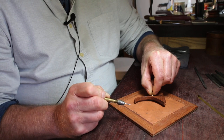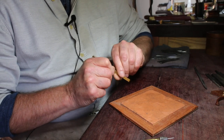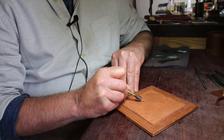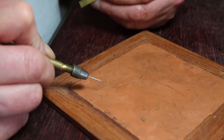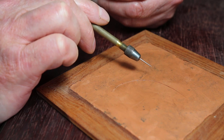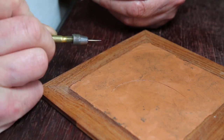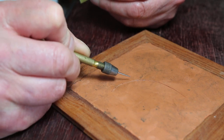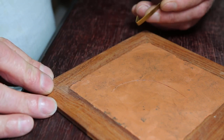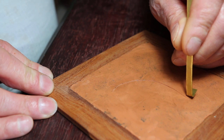I'm just doing that little line and it matches that curve. What I have to do now is take a V chisel and engrave a little V cut just on the inside of this scribe line, leaving a little bit of a lip. So now we have our scribe line which describes the shape we want to inlay. The next step is to engrave a little V line just inside that scribe line. The distance is a matter of judgment — about a millimeter in this case because it's upscaled.